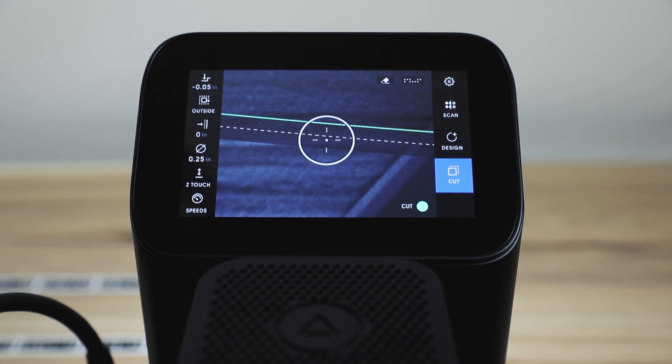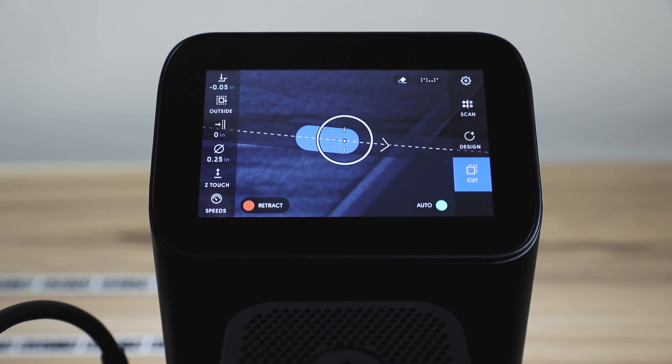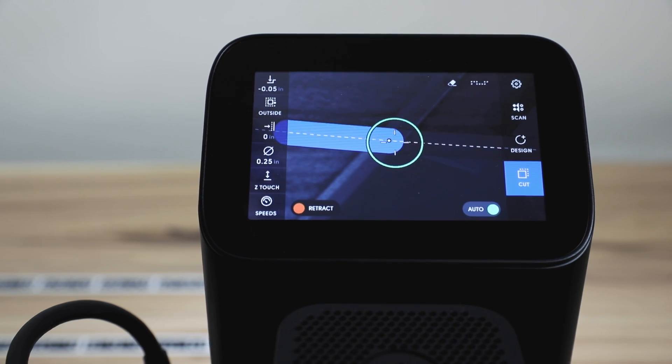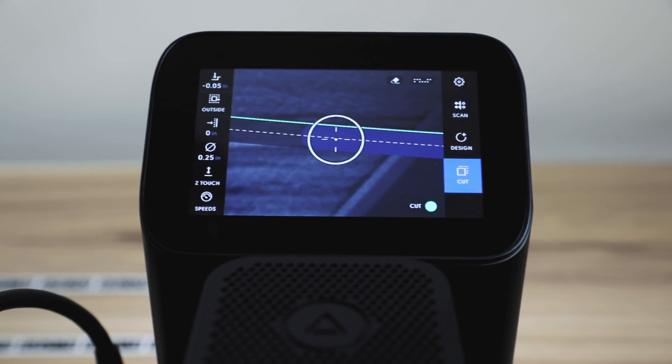Auto lock mode. We're familiar with auto mode, so I'll just do a regular cut here. Green button clicked — now we're tracking as normal. Holding down the green button again activates auto mode. You see the center corrective range turns green — that's a fixed feed rate. Origin manages that as long as you hold the green button down.